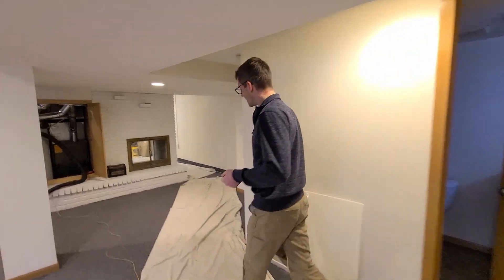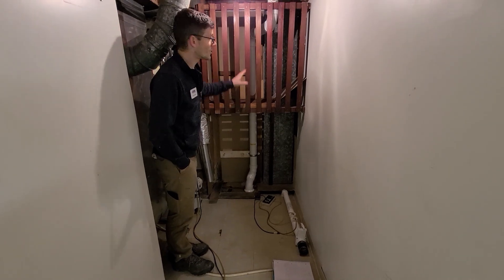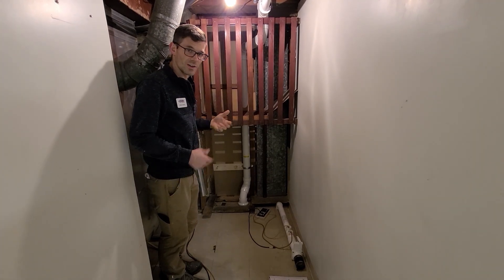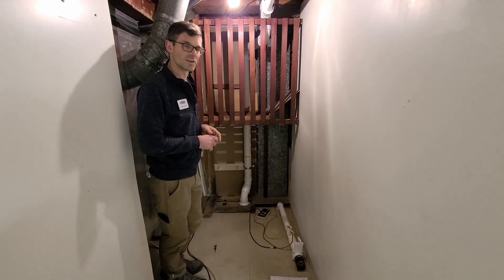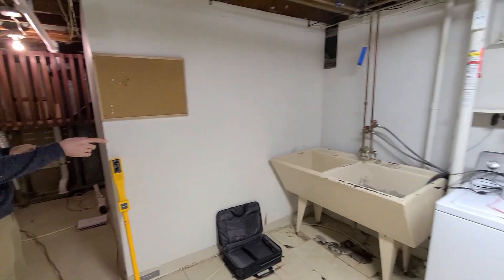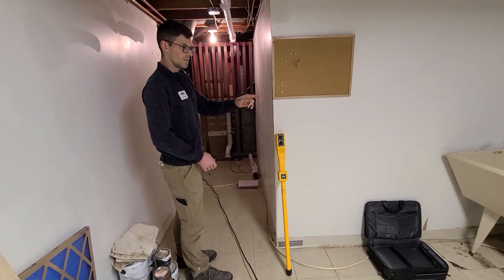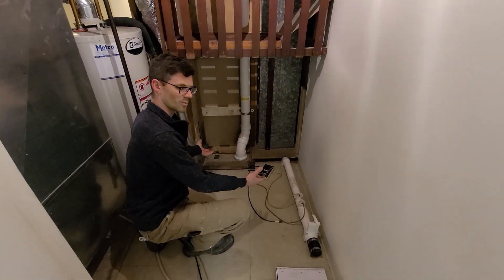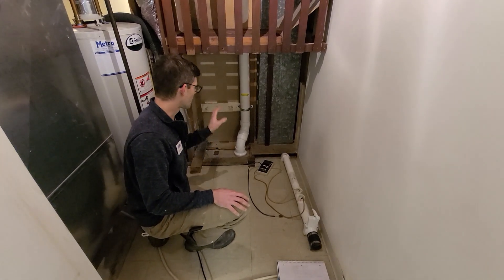Let's go take a look at some of the other suction points. Our first suction point is here. The reason I chose this location is there's a closet right above us that we ran our pipe up through to get to the attic. On a house without drain tile like this one, it's clay below the slab and it's really hard to move air through clay, so we want to find some settling to move air through easier so the fan doesn't have to work so hard. There's plumbing for the kitchen above us and a floor drain, and I was able to use my metal detector to trace where that cast iron plumbing runs — it runs right through here — so that's why we put the suction point there. We're going into looser soils because when they lay that plumbing in they dig a trench, put the plumbing in, and kick the soil back in so it's not as compacted.